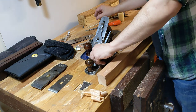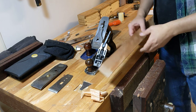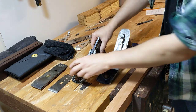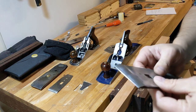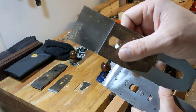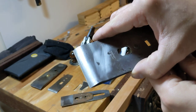To reset this plane is going to take a minute or two, so I'm going to save you that. I also had to raid one of my old planes and cut down the stud to allow a completely different setup, so I'm just going to switch to a different plane - I haven't sharpened any differently. Now this cap iron is set up very, very differently than this one. This one misses - a quarter inch back and it's still going to do the same. This one is set really close - it's tricky with phone cameras to show it, but it's close.